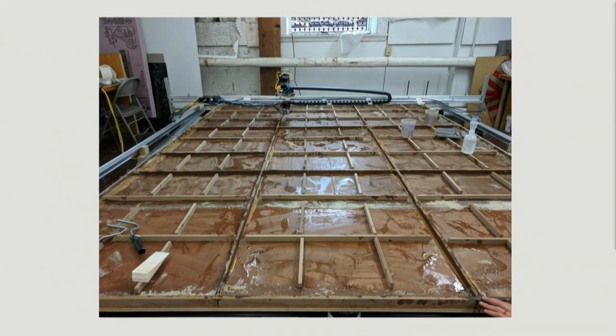Pictured here is my friend Chewei Wang. He works at Pratt. He designed with his students a CNC machine for making inflatables. The way this thing works is you put your two layers of whatever it is, polyester film or plastic or whatever blimp material or inflatable material, and it goes around and cuts it out, and then you flip the head over and it goes around and seals the edge.